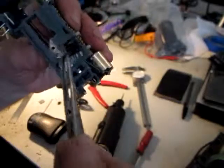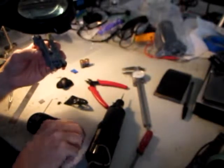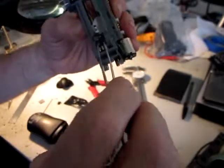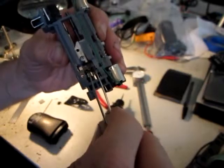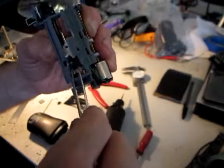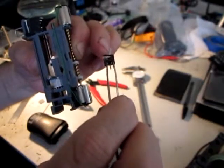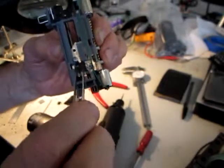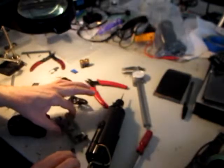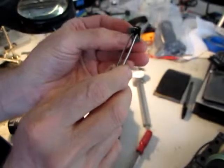What's going to happen is it's going to sink down slightly below the level. So the switch is going to lay right in here, just like that. I machined — or dremeled — away some of the plastic so that this is allowed to drop in flush. The brass piece is hitting the little lever on the microswitch. It sets flush inside there. In order to hold that there, I'm going to add a piece of styrene, and this microswitch will be glued right in the corner of this piece of styrene.